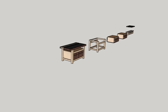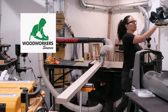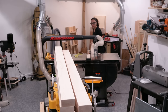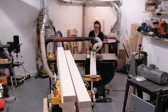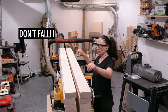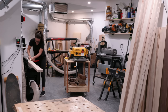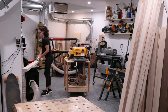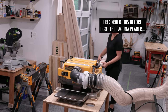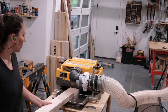I started with the traditional hardwood top made from soft maple from Woodworker Source. I was aiming for a final thickness of three inches, so I ripped these planks oversized just to get them all to the same width. These planks will be face glued together to create the thick top, so I wasn't worried about cleaning up any edges at the jointer just yet. I only cared that the planks were straight and flat on their faces, so I passed them through the jointer on one face then sent them all through the planer on the opposite face.